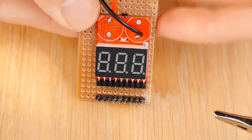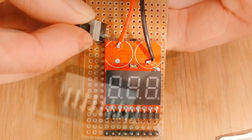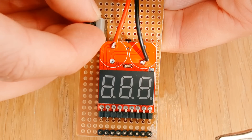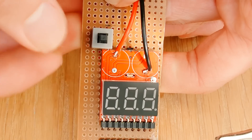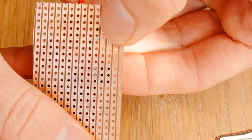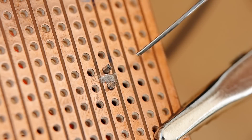So now we need to add a push button to act as an on trigger. This pin on the left is the negative pin of the alarm, so we'll push the push button in line with this pin above the alarm. We can now flip the board over and use a knife to break the copper strip between the button's pins, and then solder it in place.